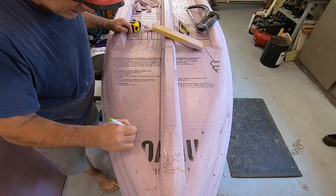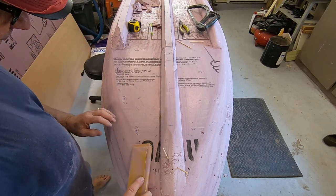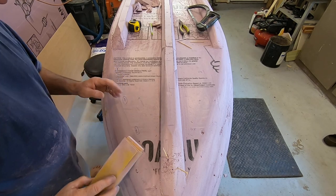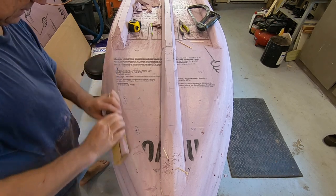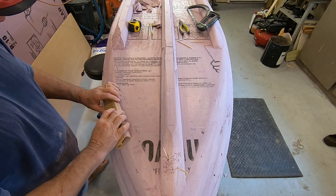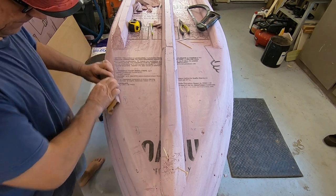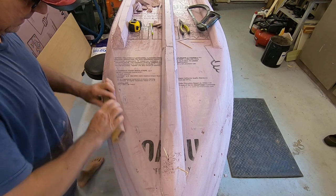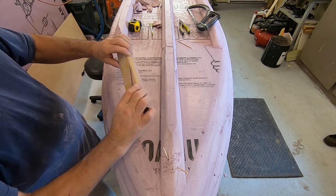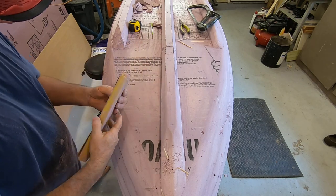Those marks right here can help you get your face uniform or symmetrical. Don't sand directly flat like this — the more flat you sand, the more you'll go over. So I'm sanding like this at about a 45-degree angle to knock some of the waste out of the way. Once I think I'm pretty close, I'll use about a 22 and a half degree angle, which is half of 45 degrees.